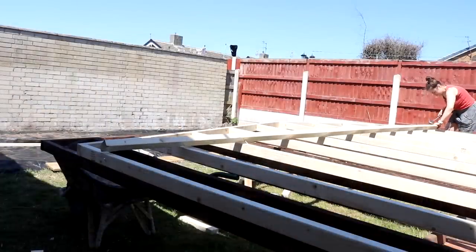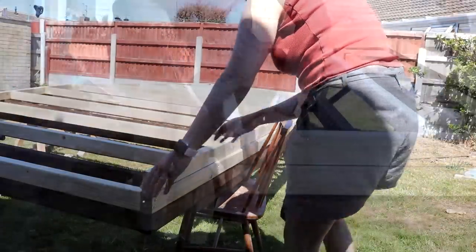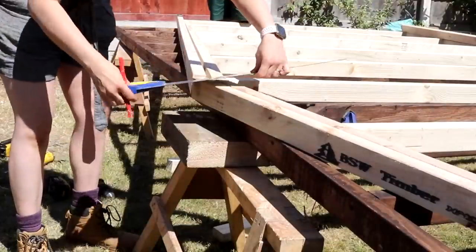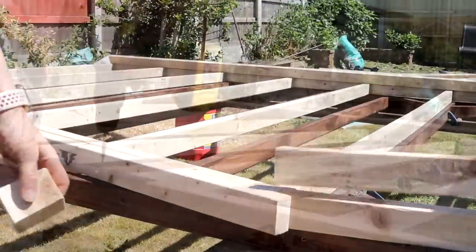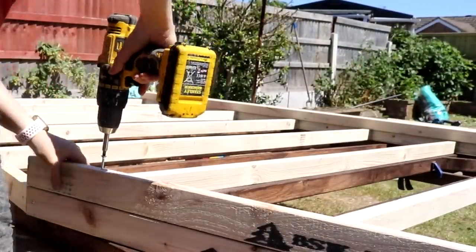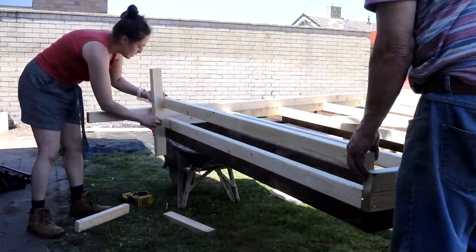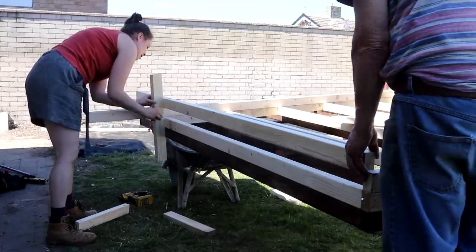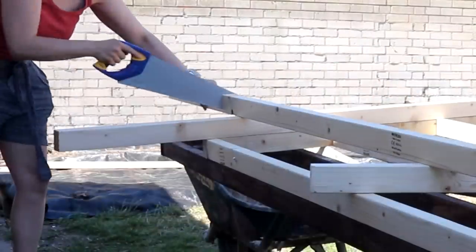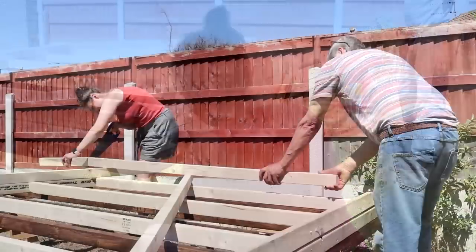That would be the next long side, but this time I'm making the front of the summer house. I'm nailing it to the first frame and we're going to completely mirror it, this time screwing the top sloping roof section to the bottom roof section. Once we had the top and bottom matching, I could line up another spar along the sides, hold a straight edge against it and draw underneath where it lied to get my new cutting line, then pre-drilled and screwed it together. And more overhang cutting.